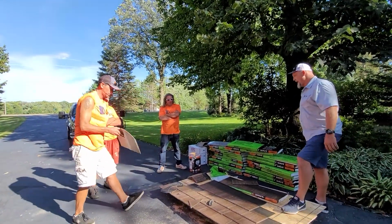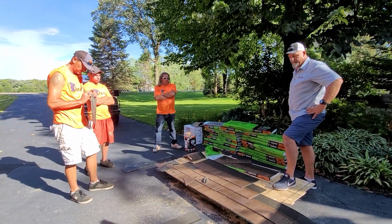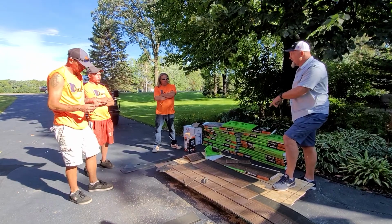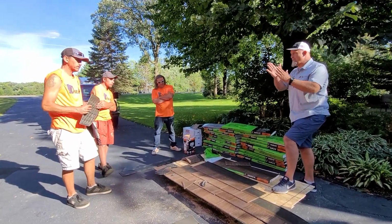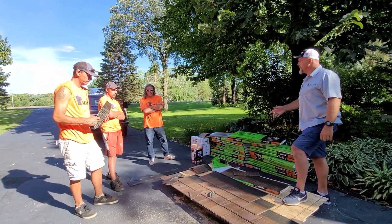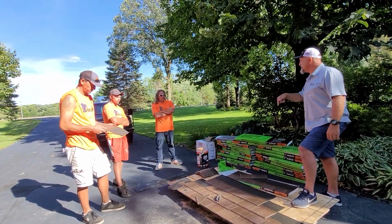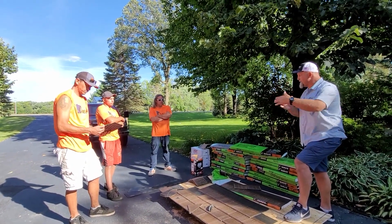I mean, this is the first roof in Minnesota, and you should be proud. You'll be excited. Any questions on the 1, 2, and 3? Does that make sense? Yeah. Just don't have them lining up looking like a brick wall or a 3-tab. So the designer slates are lined up just like a 3-tab, and we give you alignment guides going up.